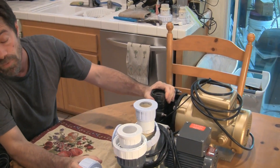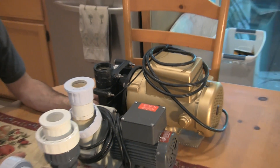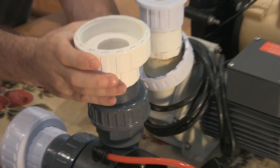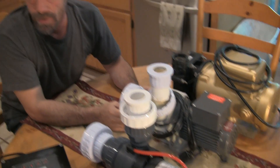What makes this a little more interesting is that my return pump was originally plumbed for a Hammerhead — two inch output and two inch input. The Darts have a two inch input but a one and a half inch output, and that is how I have my RD3s plumbed: two inch input, one and a half inch output. So I'm going to have to remove all of my existing return plumbing up to the two inch line that goes back to the tank and modify it all to connect my manifold to the one and a half inch plumbing.